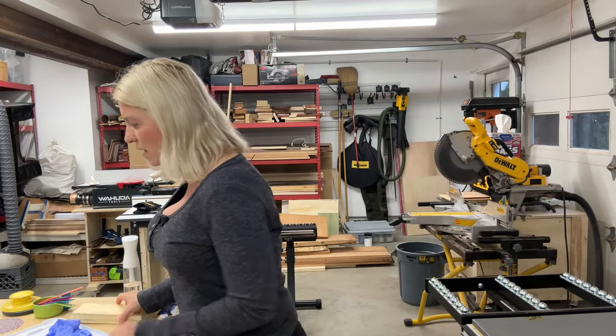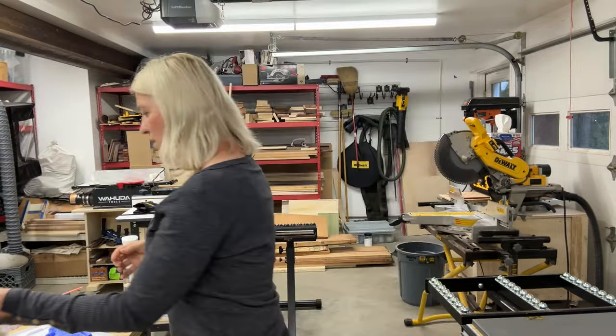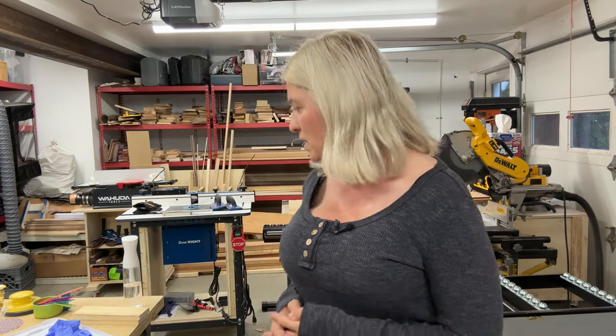We will be using oxalic acid to remove the green from poplar. When you buy oxalic acid, it comes in a bag like this or sometimes in a container. We need to talk about safety — it is an acid. Make sure you wear gloves, use a respirator when you mix it because it's a very fine powder that can fly around and you do not want to inhale it. Use eye protection, and when you mix the powder I would recommend mixing it outdoors. Also, if you get the powder on your vegetation it will kill it, and if you pour it on concrete it will bleach it, so please be very careful and dispose of it properly.